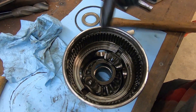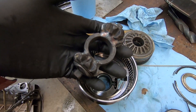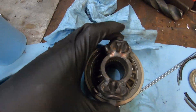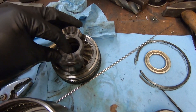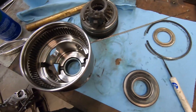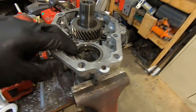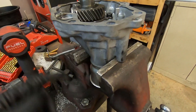Here's my solution: I welded the spider gears to the crossbar, and then what I did was I put it all in the transmission and tack welded it so that these gears are for sure lined up and will sit appropriately — clocked correctly to sit centered on the splines. Now what I'm going to do is clean all this up and reassemble it, put it back in the transmission. We'll probably pull this out to keep from hurting it, pop this race out because we don't need it anymore, and cut this off somewhere about here and weld on a new cap.